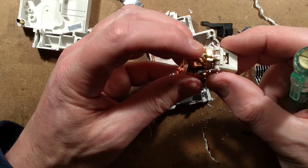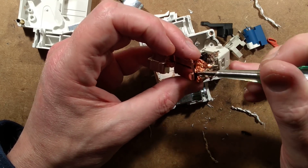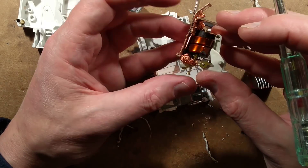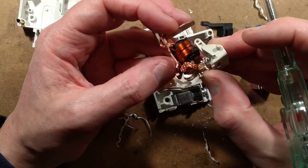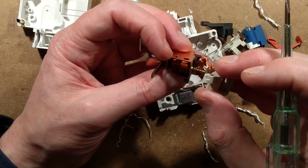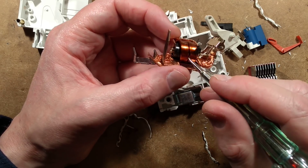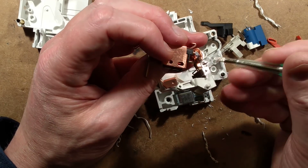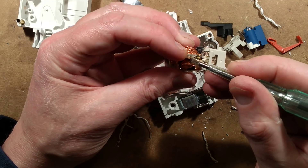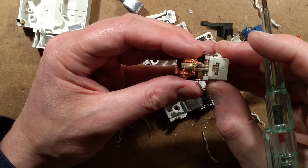That's strange — I was expecting the contacts to be just wider, but they're not. They've effectively got one contact either side with lots of braid. The centre of the braid has been spot welded onto the coil windings, and either side has then been spot welded onto the two contacts — so it is two completely separate contacts. I wonder if that's why one of them is slightly pitted and the other isn't — it's done the brunt and drawn the arc. Maybe there's an advantage to having two separate contacts that way.